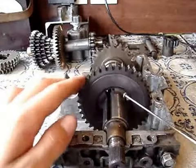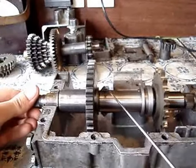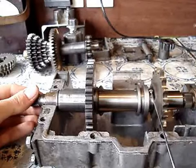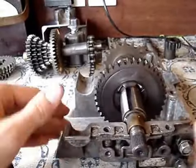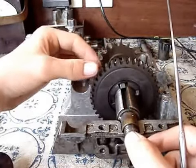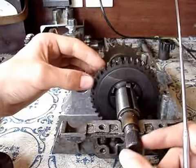Looking at it side on, you can see the four openings all the way around. Now on the gear selector you've got two lumps of metal which slide on the selector shaft, and there are two tiny ones on the back for the reverse gear. For the forward gear, what we do is put it into gear — it slides underneath the forward gear — and when you lift your foot off the clutch, it rotates, pushing against the tab of metal which is pushing against the output shaft.